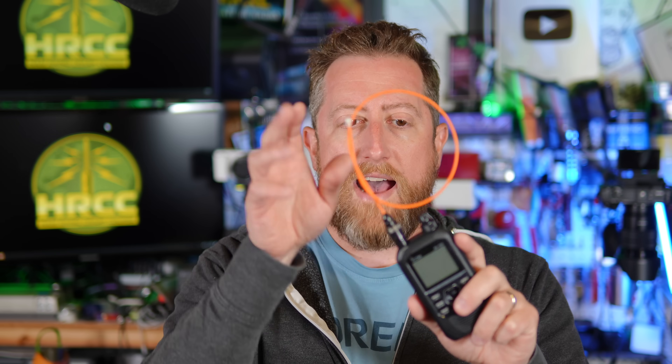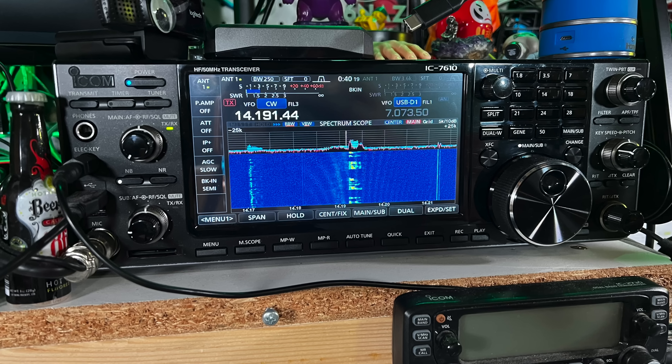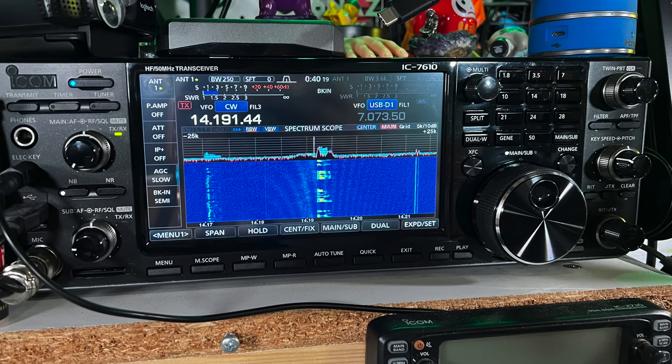This radio doesn't have a prominent VFO knob. It does — it's got a little nub in here. They all work a little bit different. Sometimes there are buttons on the face of the radio and it allows you to go up the frequencies in steps — five kilohertz step, whatever. When you click it, it goes up or down five kilohertz and you can kind of scout around. We've also talked about scanning: hold the scan button, scan the bands. In HF, 'frequency agility' — those two words — are fundamentally what makes using HF so much different from VHF, UHF, particularly handhelds like I was just showing.